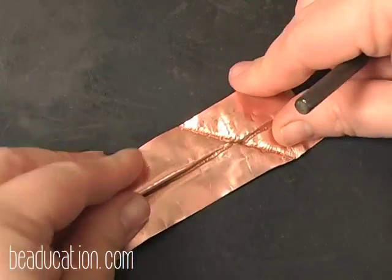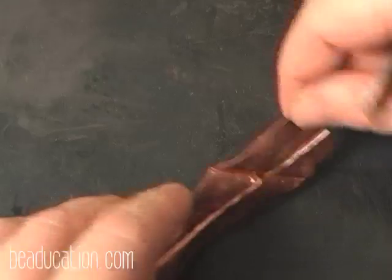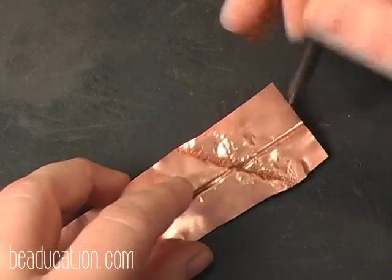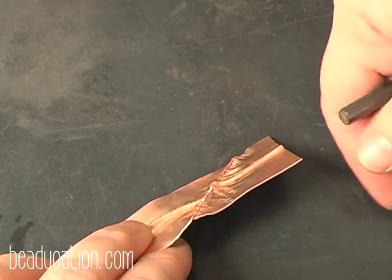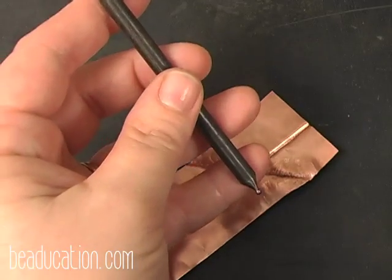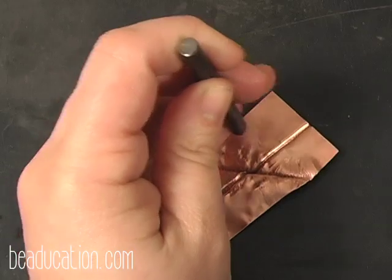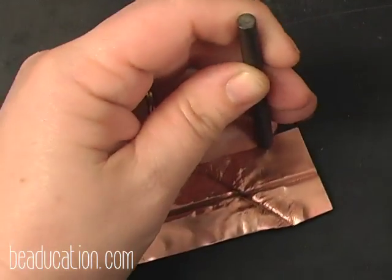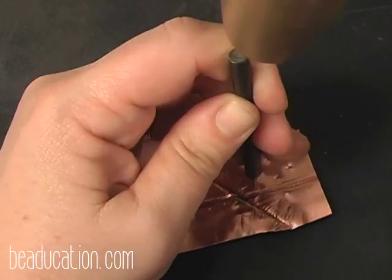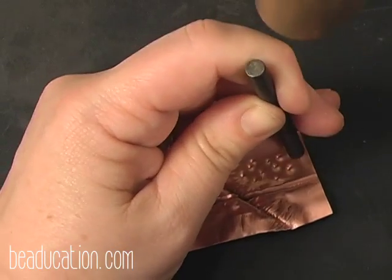It helps me keep my metals from sliding, and I also do sort of a repoussé texturing on this, whereas I'm going to have this upside down. I'm going to use just one of my very small dapping punches, and I'm going to put marks in the metal so that they are raised up the top rather than the traditional ones that go down into the metal. So you want to, of course, go back to how to properly hold your stamps so that they don't jiggle around. You want to be able to completely hold it, and you're going to come in and you're going to stamp. And I'm going to put some interesting variations in here, kind of just random around.